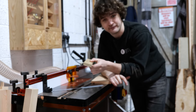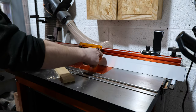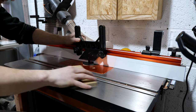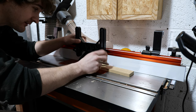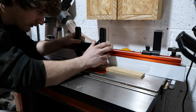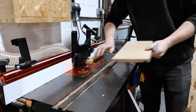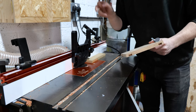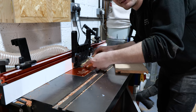To set the fence, I slide it beyond the cutter so the component will miss it completely on the first pass, then with each pass we move the fence back a tiny bit, checking the fit of the plywood as we go until we reach the desired rebate size. I'd strongly advise replacing the clear plastic guard with feather boards — they protect your fingers and provide pressure right around the cutting area so you don't need your fingers near the cutter. It makes the process easier, safer and more accurate.